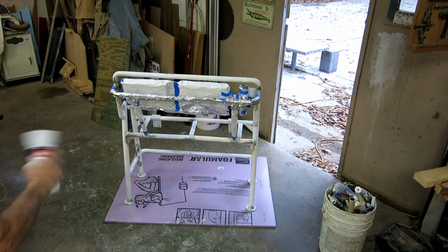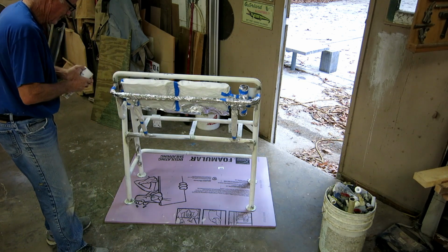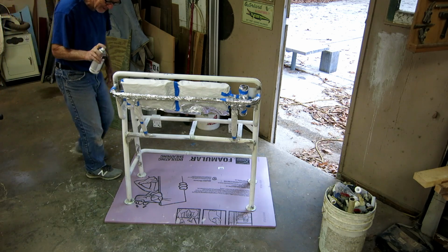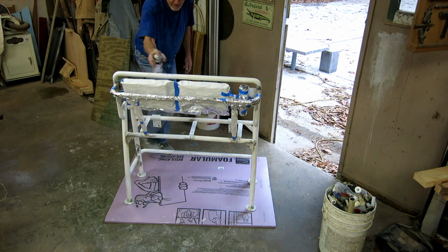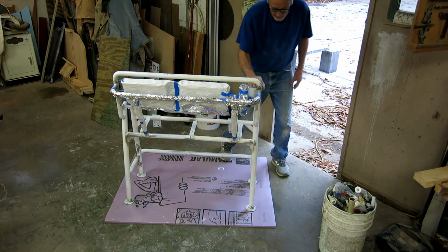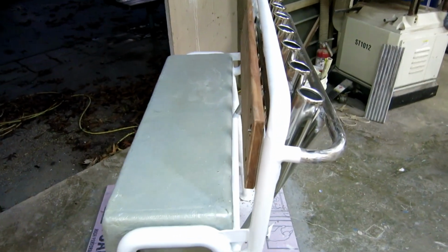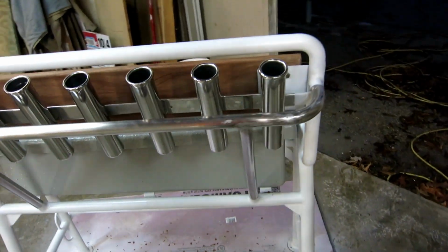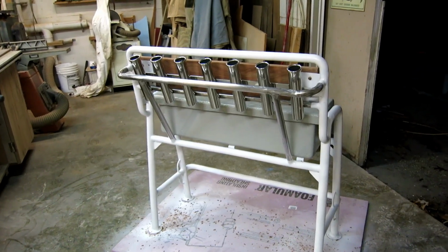And it's time to put a little paint on here, some temporary paint. I started masking with some paper and blue tape, and I ran out of the paper I had and ended up using aluminum foil, which worked a whole lot better. You could just kind of wrap it around and squinch it, and it was a done deal. So got a coat of primer and a coat of paint, and came out pretty good. And I've just ordered my foam for the seat cushion and the back cushion, so I'll have to decide if I'm going to attempt to do the upholstery myself or not.